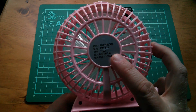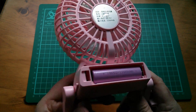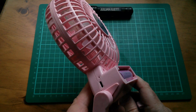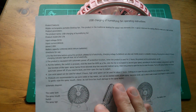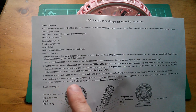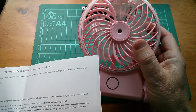What's the fan? It's a ZW178, 2.8 watts, DC 5 volts. 5 volts? They step the voltage up with a boost converter — what would be the point? DC 5 volts, 1000 milliamps, so one amp. I was thinking this thing might need deionised water or distilled water, but it says products are recommended to use pure water or tap water, cannot be distilled water. Is that so the thing clogs itself up after one year and one day and then you have to go buy a new one?